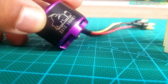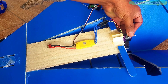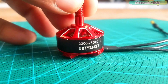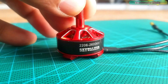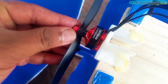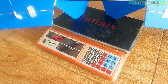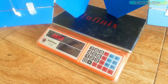Initially I started with a 1000kV brushless motor and this wasn't able to produce enough thrust to lift this RC paper airplane. Then I tested it with a 1400kV brushless motor and the result was the same. Finally I decided to use a 2600kV brushless motor which produces over 1000 grams of thrust.